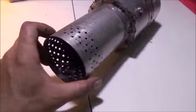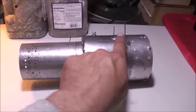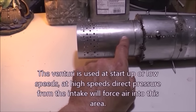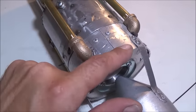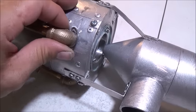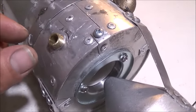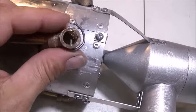This is going to act similar to a gasifier with all these holes. We're now going to build an outer case around all of this. That outer case is going to have an airflow passing over the engine, created by a venturi from the hot exhaust from our turbojet engine. Let me show you an easy way I was able to remove our ramjet bypass tubes from the intake cowling. I've created some d-rings — you push them all the way out, rotate the tube, and the ramjet bypass tubes are now detached from the intake cowling. It's just a piece of brass all-thread that I threaded into the side walls, then used a Dremel tool to remove all the threads so it's smooth and can fit inside the opening of our elbow.